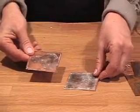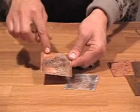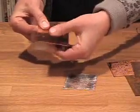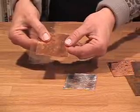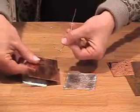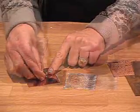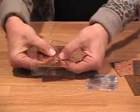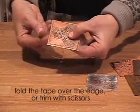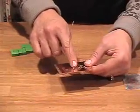These are now ready to be etched. To prepare them for etching, you need to tape off the back so that the copper on the backside won't etch away — only the copper you want on the front will etch. Cover the back with tape, but leave some copper exposed because you need to conduct the electricity. I have a piece of aluminum wire bent with pliers so it will have area to conduct and hang on to the copper. Place that on the exposed part of your copper, then put another piece of tape over the aluminum wire, making sure the wire has good contact with the copper. Fold the tape over to mask off the edge.